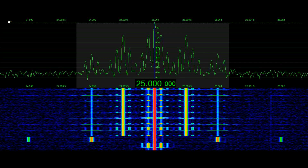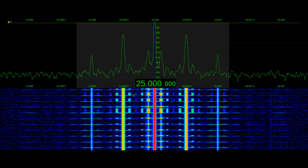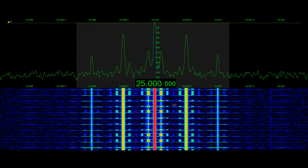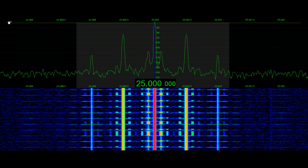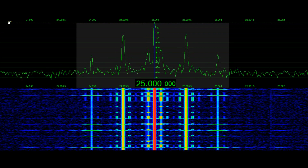The first thing I'd like to demonstrate is how, utilizing the receiver in double sideband, we can allow the lower and upper sideband components of these two signals to beat against each other, which creates a very notable effect. Let's listen into this real quick — we'll go a few cycles up and down and we'll be able to note that error quite easily.